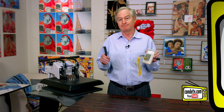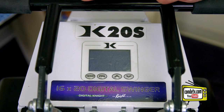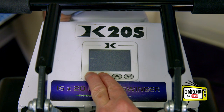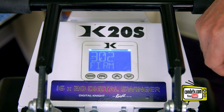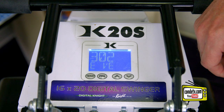So let's go over and take a look at the display and I'll show you how to do it. For illustration purposes, the press is turned on, warmed up, and it says 400 degrees, but when we measure it it's 390 degrees, meaning it's reading 10 degrees too hot. So the first step is you turn the press off and then you'll hold down the temperature and programming key, and while you're holding them down, turn on the press. It's going to enter service mode and in just a second it's going to show us the menu that we need to see.